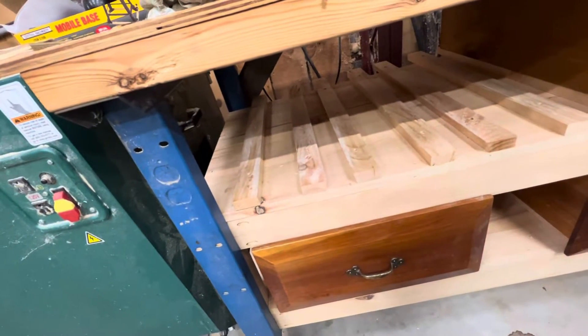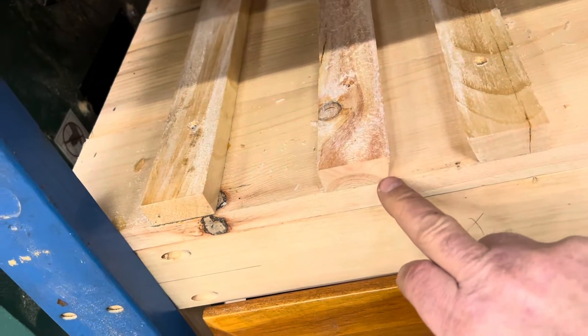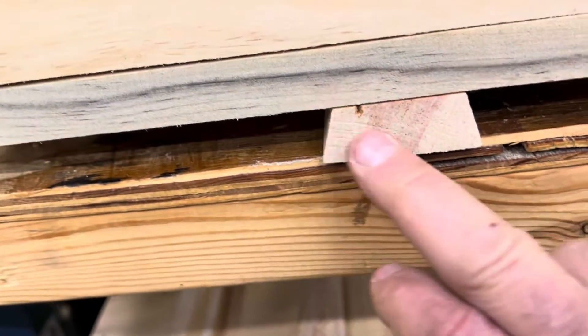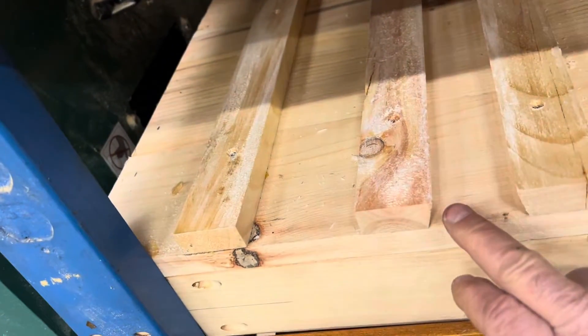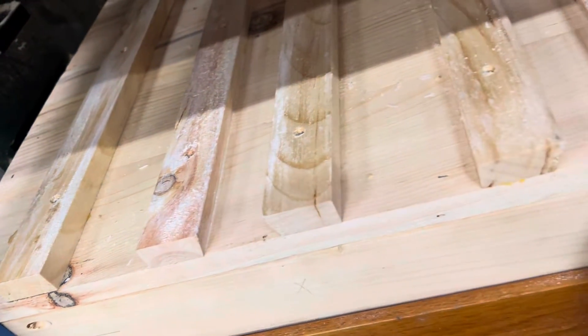What I wanted to show you here is what we've done. This is cut at 15 degrees on the table saw — 15 degrees on the table saw. I put two slides on this drawer because it's so wide — 15 degrees and 15 degrees. And then up here I've got a corresponding 15 degrees and 15 degrees. What I did was I cut a wedge that's 1/16th that I put here, so when I slide this in, I've got a 1/16th inch of tolerance to slide these in.